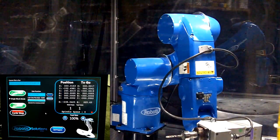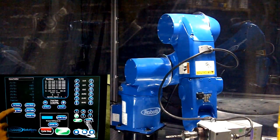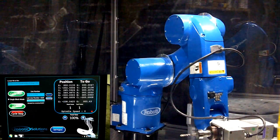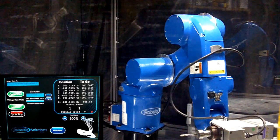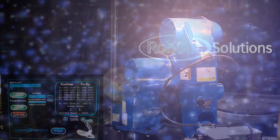If the robot gets stuck on the material that you're cutting, you can touch the Robotic Solutions logo to open the advanced menu and select the Depart from 50 millimeters button to jar it back from the material. From here, hit the home key to return to your job and select the Resume button to continue. Be sure to use the pause button and not the cycle stop button if you are doing any sort of maintenance and you do not want to lose your place in the job being executed.